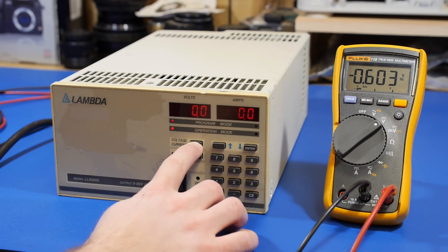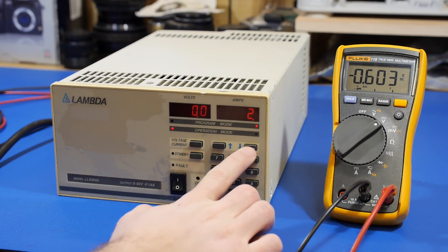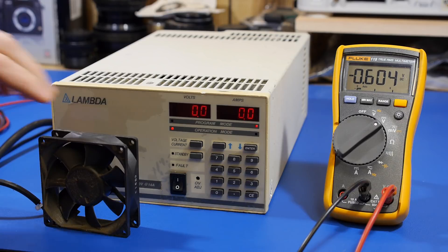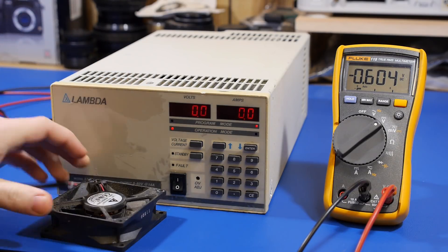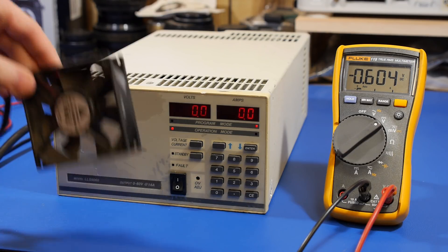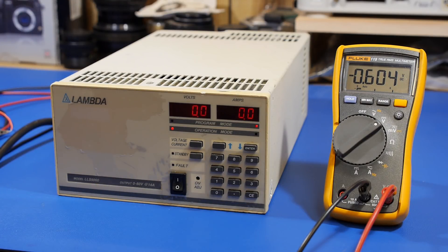The same thing going back to constant current mode — you can put, say, 2 amps, and it should restrict based on 2 amps input. That goes to zero, of course, because there's no load. So I'm putting a load on the power supply now. I have a standard 12-volt computer fan hooked up to it, and it is doing absolutely nothing. What's nice about having just a simple fan here is that I really don't care if it gets destroyed. Regardless, I'm definitely going to have to take this unit apart and look at it further.